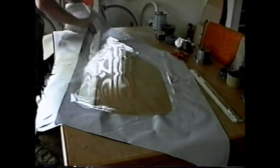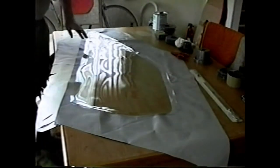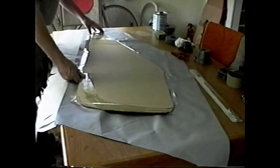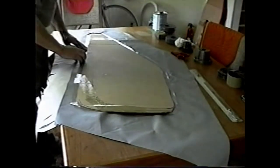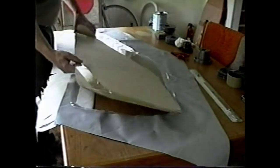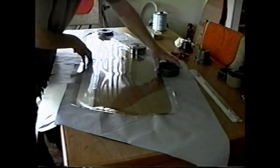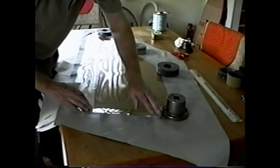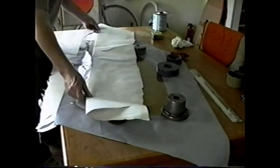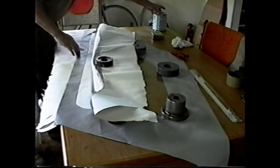This piece of paper has to go down underneath the vinyl, even on a surface that you don't want to preserve, because you have to remove it before you paste the window down, or you will get cement all over the clear spots of the window. So after putting it underneath, reshape and relocate the window so everything's squared away, and then put weights on it so that things don't slide around. Paper to keep cement off of the window. And we're ready for gluing.